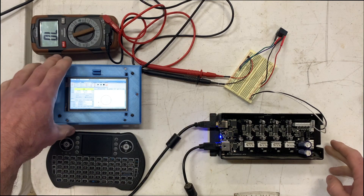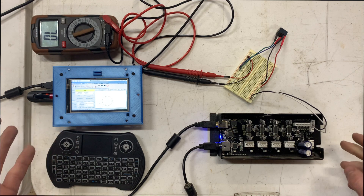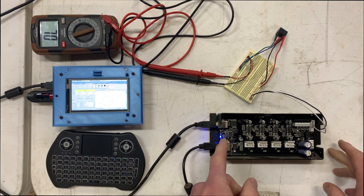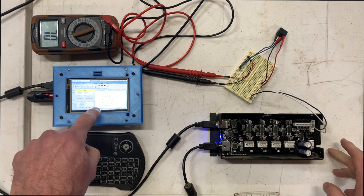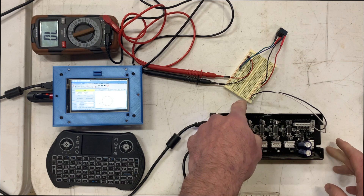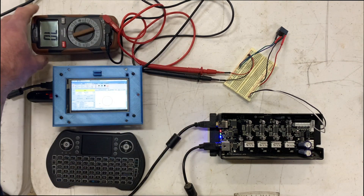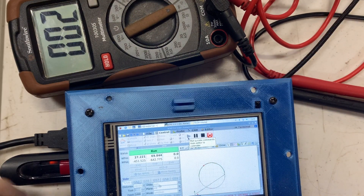We're going to run a little simulation to see if this all works the way I think it's supposed to. I've got my Raspberry Pi running my CAM software connected to the Shapeoko control board, and I'm going to run some g-code that will send instructions telling it that it's cutting a circle. We're not connected to any stepper motors so nothing will actually move. After it thinks it's done with its lead-in movements, the PWM pin should send five volts to the breadboard, causing my relay to switch and close the circuit on the two leads connected to my ohmmeter. As it approaches the beginning of the circle, the relay switches and my ohmmeter shows the circuit is closed.